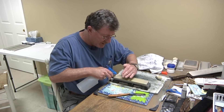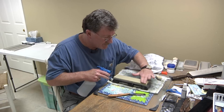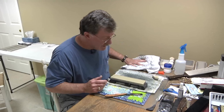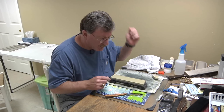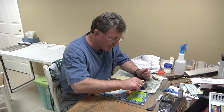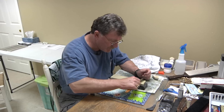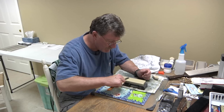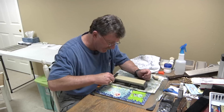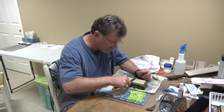At this stage I start fresh — I'm going to knock off as much of the slurry as I had before, and now just go to water. Typically I'll stay with 10 strokes; 10 to 12 should work from a reference standpoint. No pressure — just very light X strokes. You can tell by the water displacement that the edge is just moving right across here, and I can feel the resistance of the stone, which tells me it's still cutting. That's really what we're looking for.